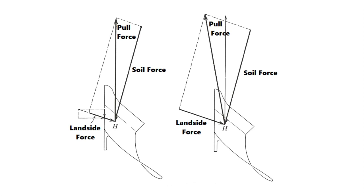The pull force always travels through point H because the plow hitch does not float in the horizontal direction. Even when pulling directly ahead of point H there is always a landside force. Pulling directly ahead is ideal but not always practical — think of a single bottom walking plow pulled by a three-horse hitch. When the pull force leads to the left, the landside must absorb that perpendicular component plus increased friction, but the landside can handle it. If the pull force leads to the right, the landside force decreases a little.